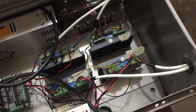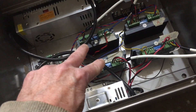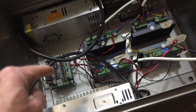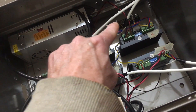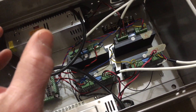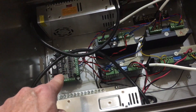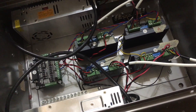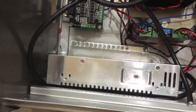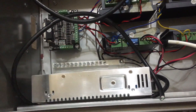I cut up the sides of the filing cabinet and fashioned a lid that simply lifts off. Inside you can see all the components: four stepper drivers, two power supplies, and a parallel port breakout board. Down here I have a five-volt bus — I'll attach a five-volt power supply to the sides and run power to that bus, then out to the breakout board and the circuit board sides of the stepper drivers. I also have a ground bar where all ground wires connect, with a ground wire running from the power supply to that ground bar.